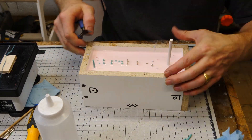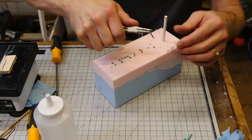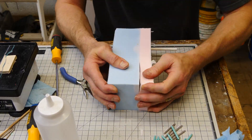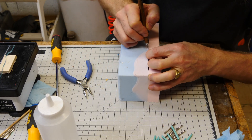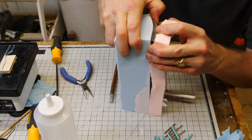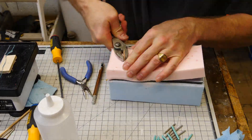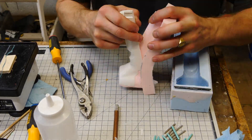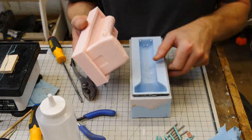It's time to separate the two halves of the silicone mold. We'll remove the mold box, then remove the vents and the pour sprue. This is a time-consuming process — takes a little while. Some of the silicone has spilled out into the bottom of the blue area; not a big deal, just cut it. Then we'll go through and gently pry everything apart. There's a little bit of a connection in one part that I have to cut with a knife — not a big deal. It comes apart and we'll take the master part out, and we'll be ready to put the molds back together and make some parts.